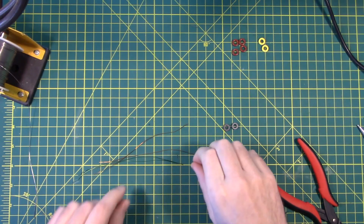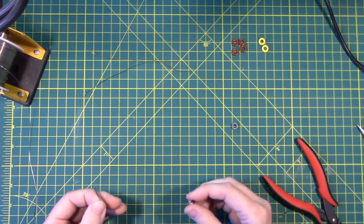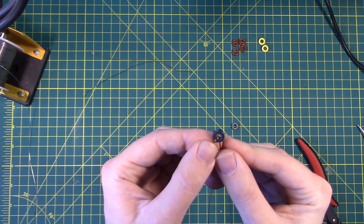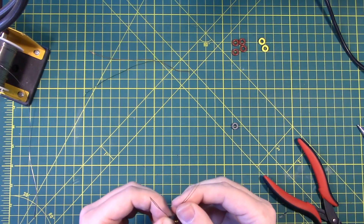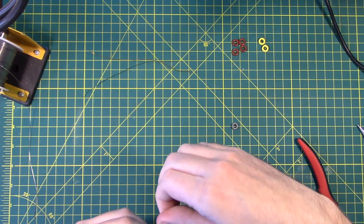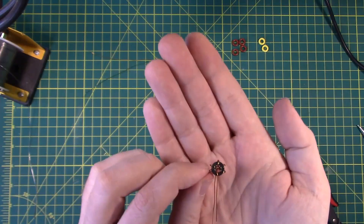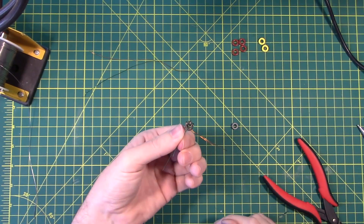We're making two of these so we'll need two sets of six-inch wires. The instructions say you can lightly twist them together or not — it doesn't matter. I'm going to choose not to. Five turns on the core, and you want to wind up with the wires split off at the end by their colors. The green is the AA wire and the copper is the BB wire — that'll become apparent when we put them on the board. Count the number of times it goes through the core: one, two, three, four, five. Good to go.